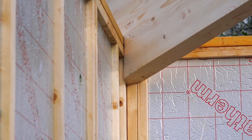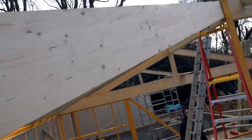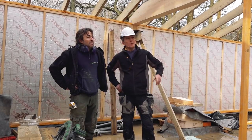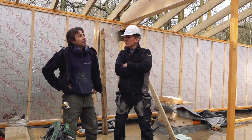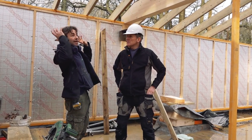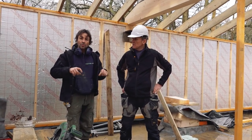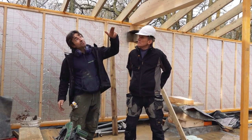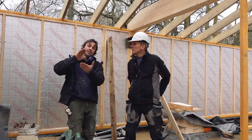They've cut their 45 with a machine which is not quite 45 — that'll be alright. Getting this in the dry, Robin. You've got sarking board? Yeah, we've got 18mm OSB. We've got 600mm centre rafters. What we're going to use is 18mm OSB, 8x4 sheets, running the opposite direction. So I'm going to counter-batten with a 25mm batten, enabling me to put one all the way through where the joints are — long ways — and then on top of the rafters this way as well. It also enables me to get above the tie of the glulam beam for ventilation.